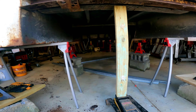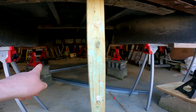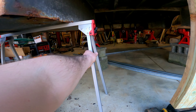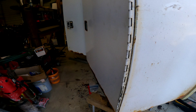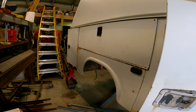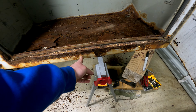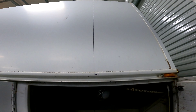I've got a jack supporting that, jack stands in each corner, one in the middle there and there, and then the far back ones. These are going to hold things so when I cut right there that whole chunk isn't just going to fall down — it'll be supported by that. The whole bed will be supported by the middle ones, so I am safe to cut. I've got my line here, made a line up here and around the other side.